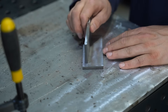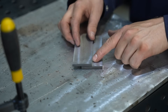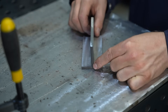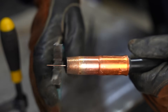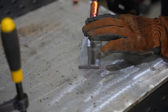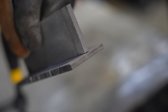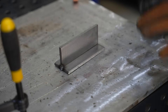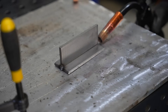I'm going to put these together in a T-joint. When you're practicing fillet welds you can do them in a T-joint or a lap joint — it's worth practicing both because they'll both come up on projects. I'll put my tack on each end so it doesn't get in the way of the weld itself. My wire is sitting a little bit long for short-circuit MIG so I'm going to clip it off. Notice just from that tack how it distorted and opened up the joint at the end, so I'm going to need to hold that down while I tack the other side.